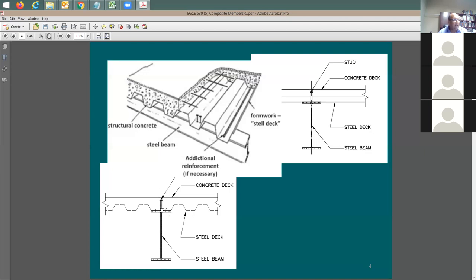For the other beam running in the perpendicular direction, you can play with the spacing the way you want - you could put it at six inches. But for the beam supporting the metal deck, you cannot put it at six inches because the deck meets it only at 12 inches. In contrast, for the girder the deck has continuous contact with the steel beam, so you can put as many nelson studs as you want. The deck acts as formwork - you put the steel beams, the framing, the metal deck, weld the studs, put the reinforcing bars and mesh, then pour the concrete. You don't need to shore.